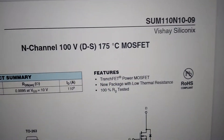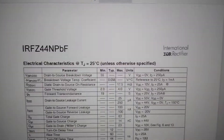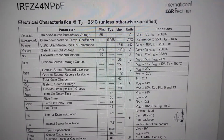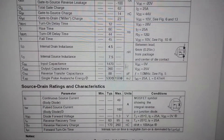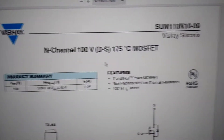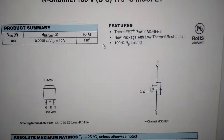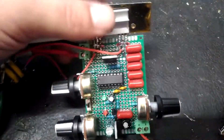They're SUM110s — 110-amp FETs. They're not particularly fast compared to the Z44N, but they've got about half the on-resistance. It seems like that's really what you're looking for: a very low on-resistance. So these are quicker than the ones I'm using here, and at half the on-resistance they perform quite well when it comes to pulling hot arcs at continuous wave.